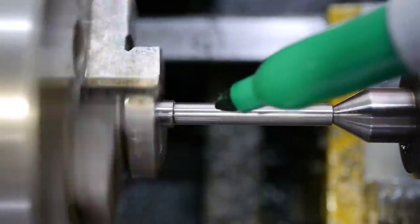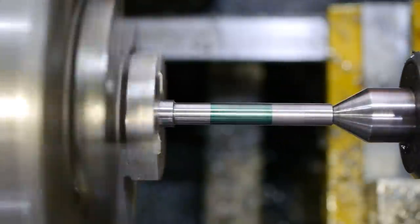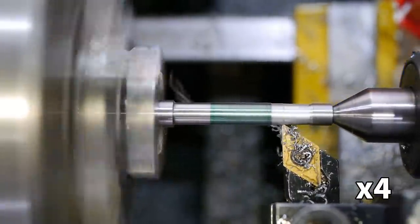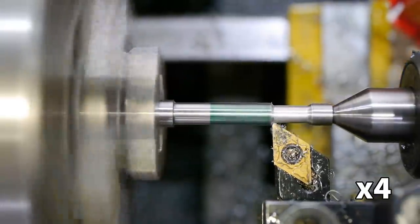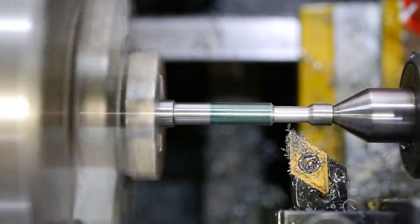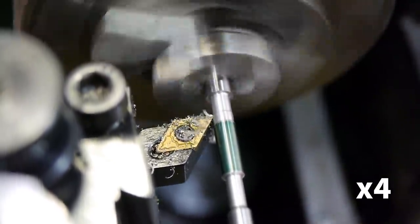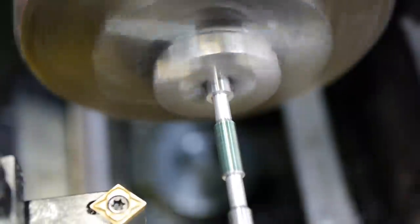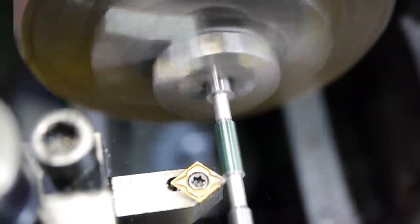Cutting the thread cleanly required a gutter near the chuck to start and plenty of space at the end, so I marked the section to be threaded with a Sharpie and cleared the necessary space. A quick touch on the end of the thread with a chamfer tool and the part is ready for threading.